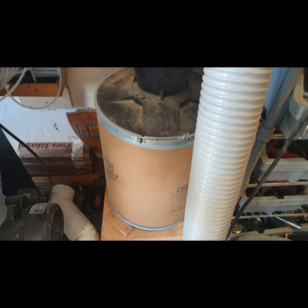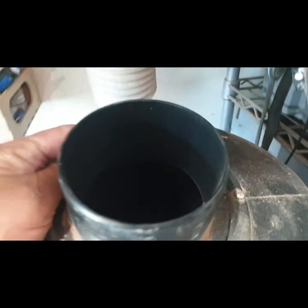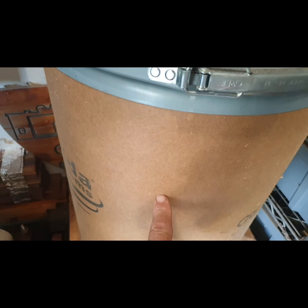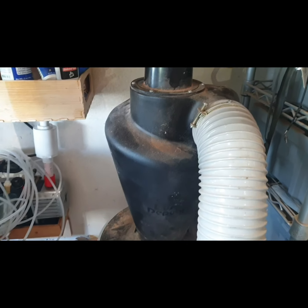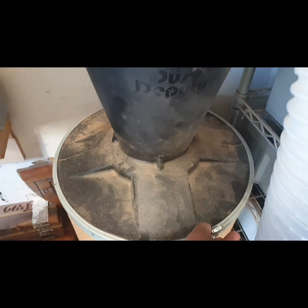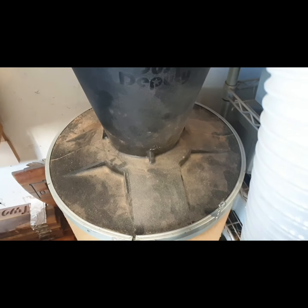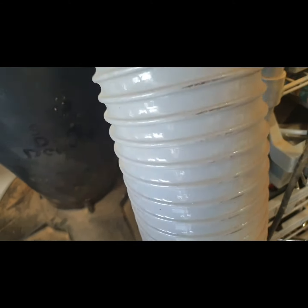It's been a little while since I emptied that barrel — it's 15 gallons. What I do is just pop that up, shine a light down in there, and check the dust level. Generally if the dust is up to about that point I empty it, because if it gets higher it sends it through the system through the impeller. So I just take this little thing off, open it up, pull the pin off, and slide this out. That oak dust is a little heavy.